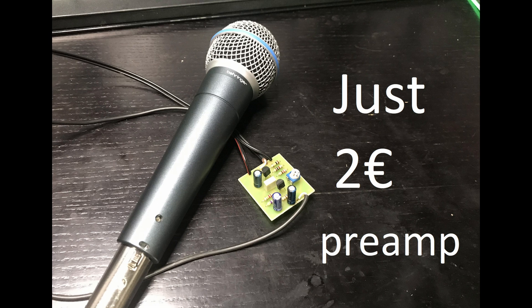As you can hear, the sound quality is decent, especially when we consider the price of this solution. It would be good to place this preamp in a metal case to shield some noise, but it can be in just a cheap plastic box, or just leave it without any case if you are brave enough. Common cheap preamplifiers won't be any better until you reach a really high end with prices over 100 euros. So if you can do some basic soldering, I recommend you use this solution or a similar kit. I hope this info was useful for you. Bye.